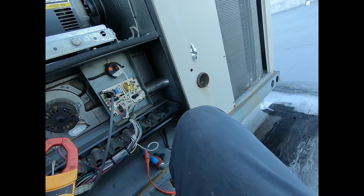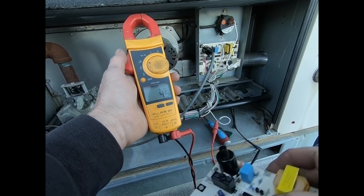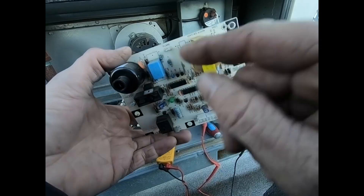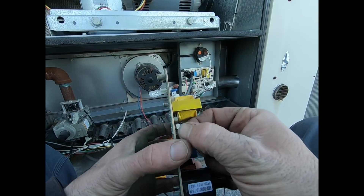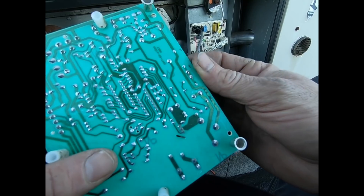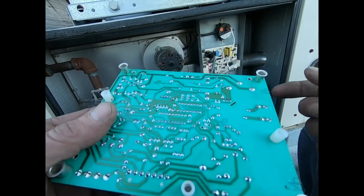Where's the old board? There we go — oh, there you go. We got flame current! Just what the doctor ordered — a little flame current. Look, it's got greenish stuff on it. Forgot the blower was about to kick on — a good little startle's always good. I was looking at the board, I forgot about everything. But I got some white crust.